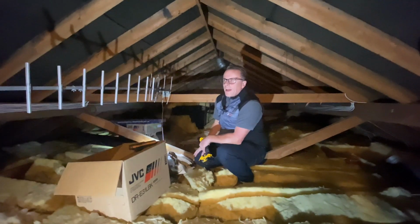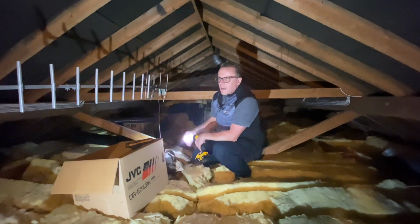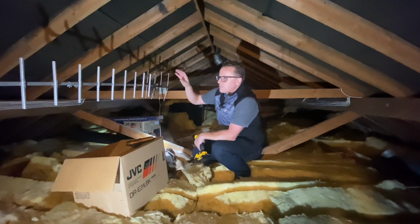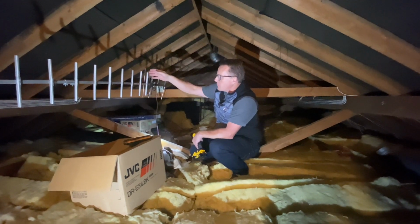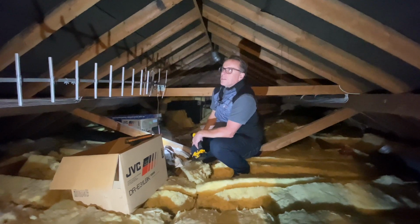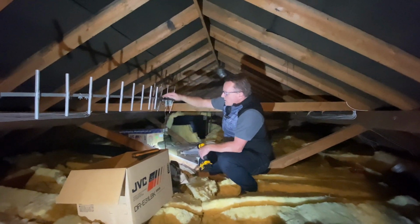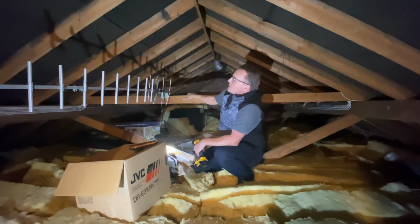Okay, so outside we survey top down, inside generally survey top down, and I'd like to start in the loft space if we can. So this is a traditionally built roof, goes back really hundreds of years, cut and pitch, so standard size timbers that were brought into site, and then a carpenter would spend a couple of happy days cutting all these to size, with plumb cuts on the ridge board, seat cuts and plumb cuts over the bird's mouths to form the frame as we see it.